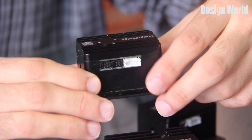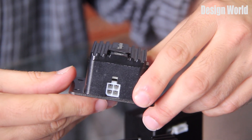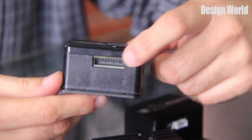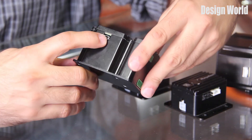There's also an encoder input with stall detection with verification as well as position verification. Depending on the model or part number, input voltage can range anywhere from 12 to 75 volts DC with maximum drive currents per phase from 0.6 amps to 3.85 amps. Communication protocols include options such as RS-485 or mini USB.